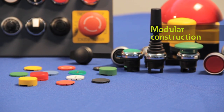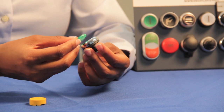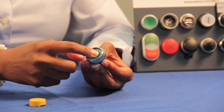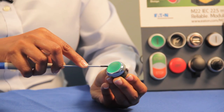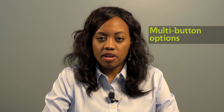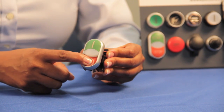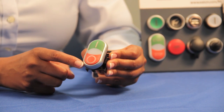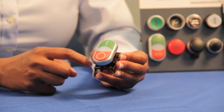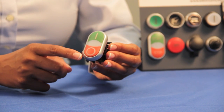Our button plates come in six color choices and we also offer custom engravings. To install a button, align the notches to the tabs inside the operator and secure it with an easy snap. Removing the button is also easy — just look for the highlight mark on the button and detach it from the operator by sliding using a slim screwdriver. The other unique feature on the M22 series are multi-button push buttons including a two-way button or a four-way push button. Take this double push button for instance — it comes with two push button operators and an indicating light. With one push button you can achieve the functionality of three operators, so just stock one of these push buttons and use it as an indicating light or start-stop push button. Our multi buttons are great for increasing functionality where space is limited on your panel.